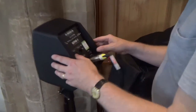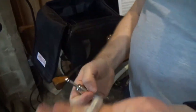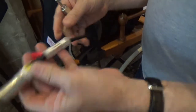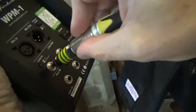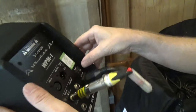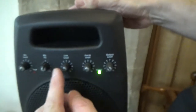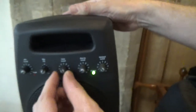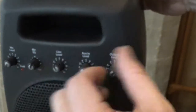There. The drum foldback speaker, when you've got it, there is a cable labeled drum foldback, it's by itself. That needs to be plugged into one of those adapters. It goes into line in. The power is on the back, and then on the front you've got input level and output level. That's about it. Those two together should enable you to hear what's going on.